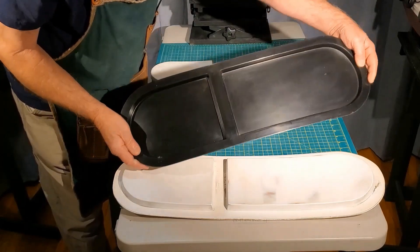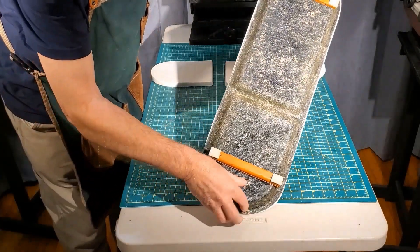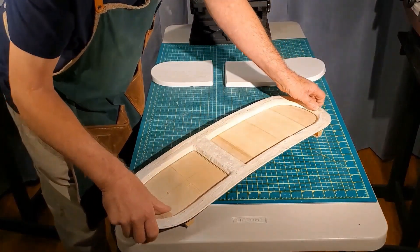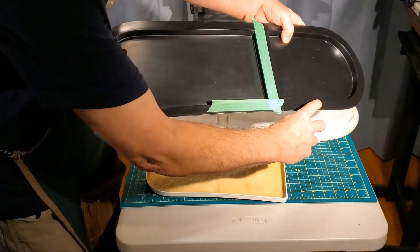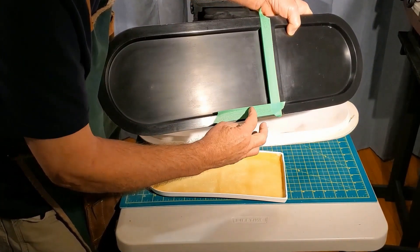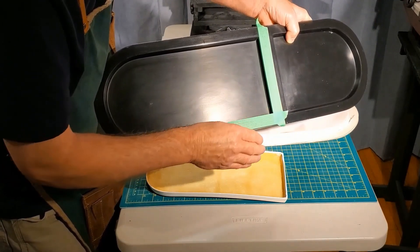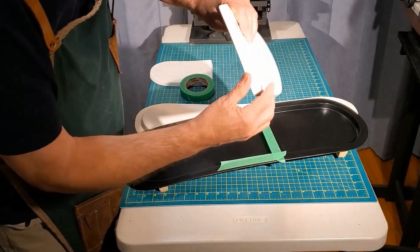I built up a mold that fits over both hatches, with supports here and here — it's quite strong. I always store the mold inside the plug to prevent any kind of distortion if it sits on the shelf for a few months. The hatch mold has a nice flange around it. I apply tape to that flange; it projects into the cavity about a quarter of an inch and forms a nice boundary for the initial gel coat and resin when I lay up. You can see here how neatly that formed the corner of this hatch.